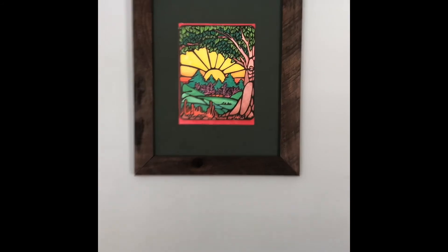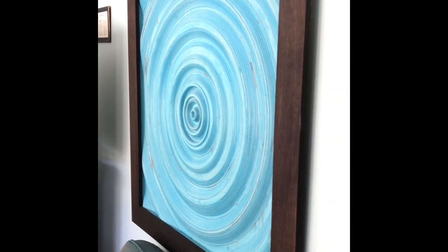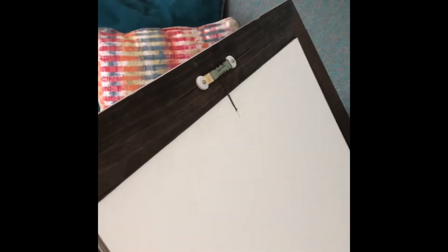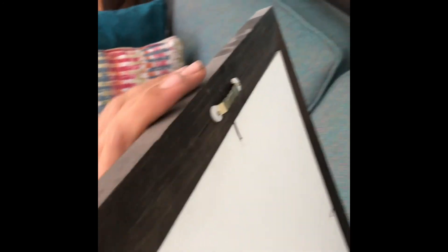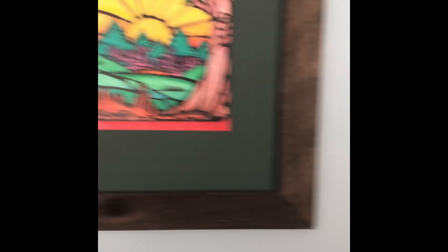On this picture here, I just tapped a nail into the wall. You can see that nail's not going into a stud — it's just hanging there in the drywall. I know if I push down on it with a few pounds of weight, it's not going anywhere. If I were to hang this big piece on that nail right now, it would pull it right out of the wall and break that piece — that would be a bummer. But we're just going to hang this little painting. I've got this sweet little clip on the back, so I just dropped that guy on — definitely not crooked now.